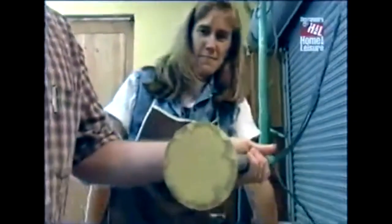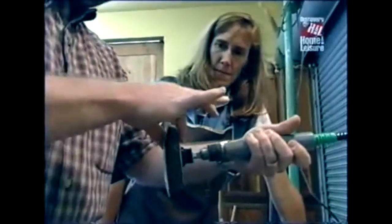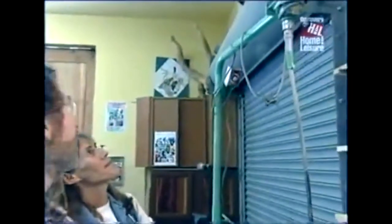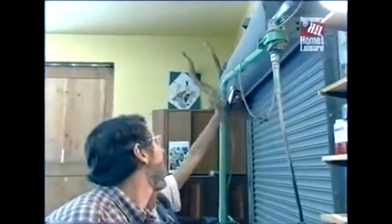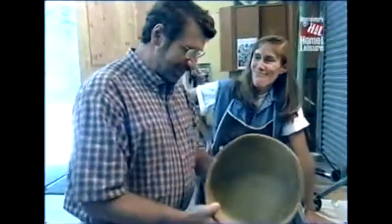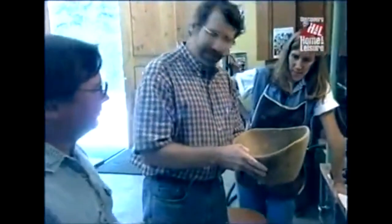So this is a disc sander on a very soft base, sticky sandpaper, on a flexible shaft that just goes up to an ordinary electric drill. Right. Walt did this. We ran it through a rheostat so I can slow it down when I have a fragile bowl. I imagine it takes quite a bit of time, but this is a beautiful one right here, nice and smooth, teak.